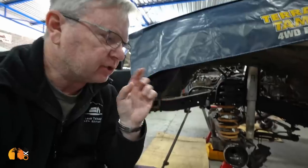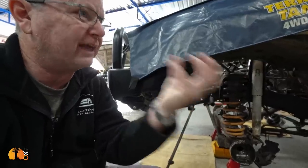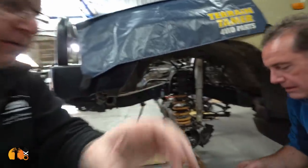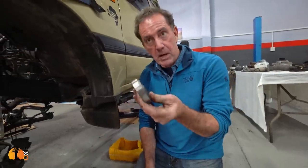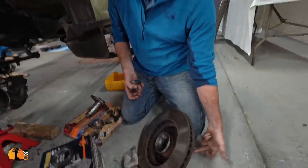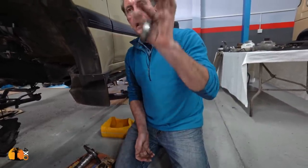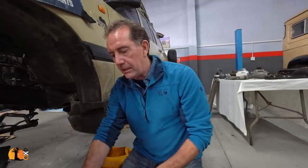So you're saying: if I'm taking bearings as spares, I must keep them matched with all the components that were taken out, put them in a place where they're all together. If I have to replace a bearing, I take the whole lot and replace the whole lot. So this is the old bearing from here, and here's a brand new one. If I take the old one out as a spare, I need to take its partner — the shell — out, and keep those together. We knock it out, tap it out, and then I take the two together and put a zip tie around so I don't mix them up. Any spare bearing you're taking — especially if you're going to reuse them — take them together, put a zip tie around, and you've got a spare set of bearings.